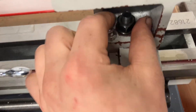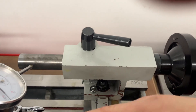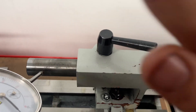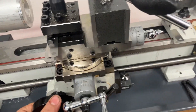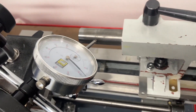To check your results once you tighten everything down, the height and the X and Y — meaning the distance side to side and up and down — are checked just using conventional methods. But to check the angle, the yaw and tilt, what you can do is set up a dial indicator on your slide and run it across the entire side. You want to make sure that needle holds steady in all directions.